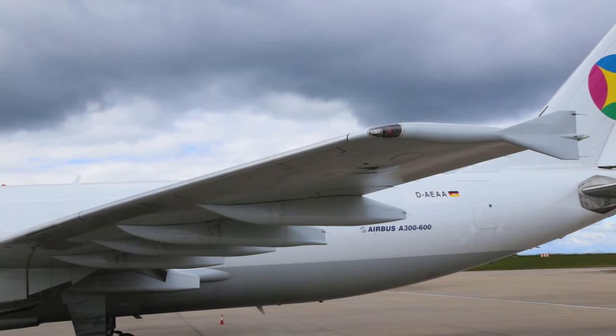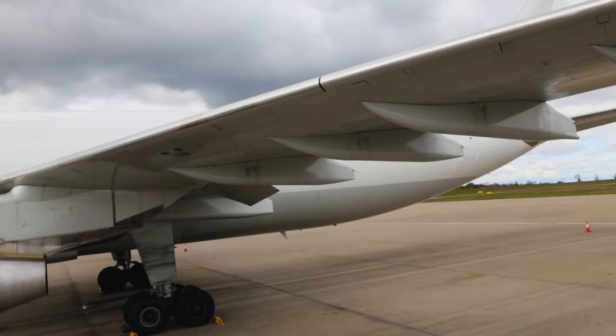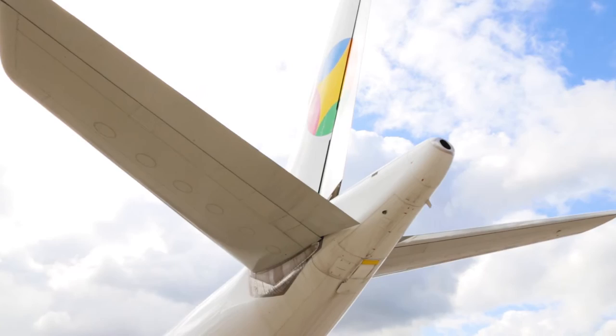As the basket goes down the leading edge, the basket operator will be looking for any frost, ice, snow on the flight controls, ensuring that they're clear of the wing. When he's spraying, he will stop and let the steam dissipate before he checks the areas. Optimum spraying is 3 meters away from the aircraft itself. Once he's checked and all the control surfaces and engine cowls are clean, and he's happy with the underneath and top sides of the wings, then we will move to the horizontal stabilizer position.